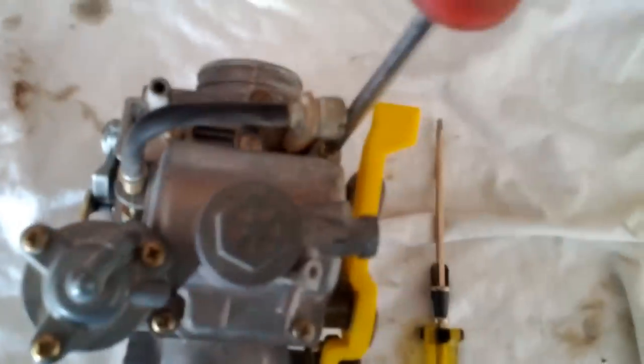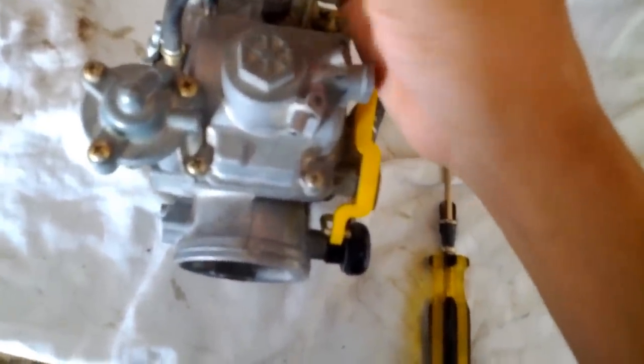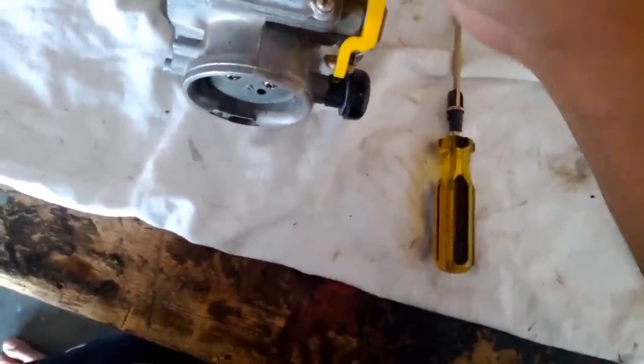Up next for checking is the float chamber. We're getting to the goods. If I have an issue with the jets, and from what I can tell, they're somewhere in here. Now, in order to remove this, you need to open up just a few screws, not all of them, just four. This one right here, around the other side. I've pre-loosened them, so you guys know this was not this easy. So once we got all four of them out, you will see the floaty that controls the fuel, I believe, to the chamber. Give me 1 second if I can do this.